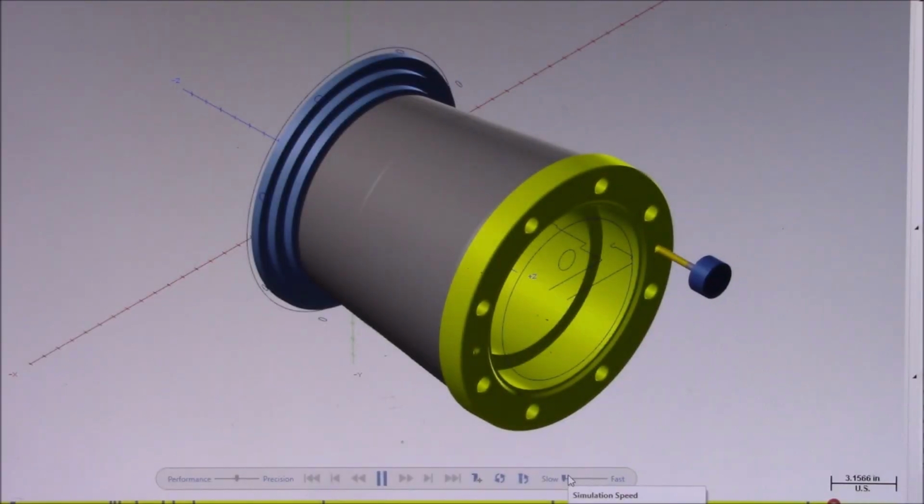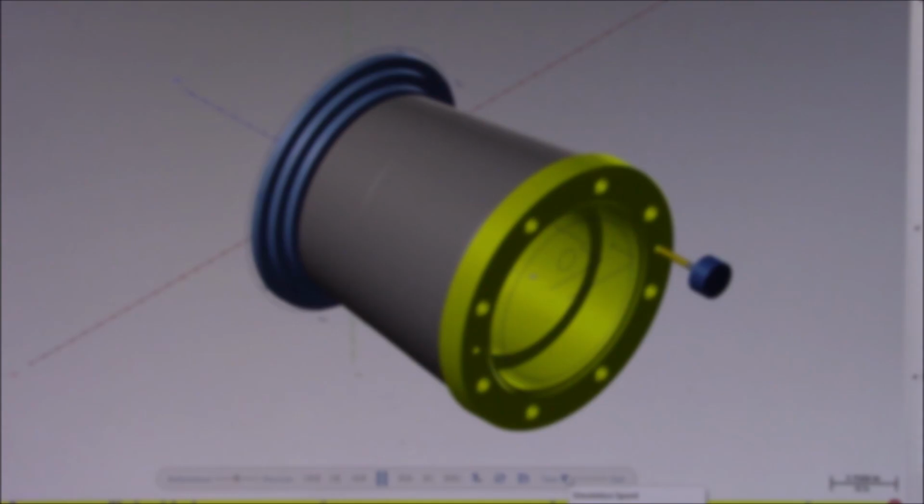The final 2 holes on the finished face are now being peck drilled. These won't be tapped and they're only going in about 1 inch deep. These 2 holes won't need to be chamfered because that was actually done earlier when they were spotted, by spotting them a little bit too deep. The same tactic will be used in the next spotting operation on the side too.